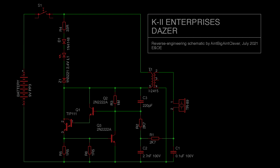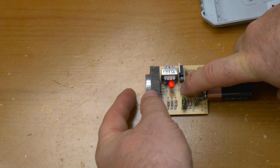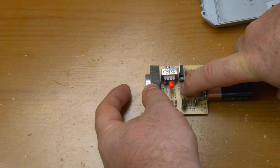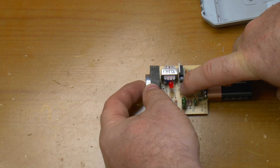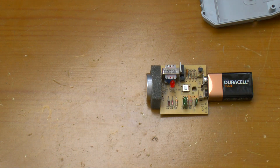Interestingly, you can see it also gets a supply via a 33-ohm resistor, a diode, an LED, and a Zener. And the odd thing about the way that works is if something interferes with the operation of the transducer, the LED goes out. The only time the LED will come on is if the thing is functioning properly. It's an ingenious way of doing it.